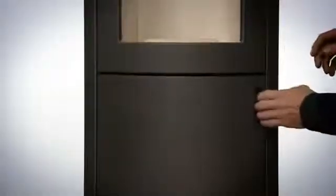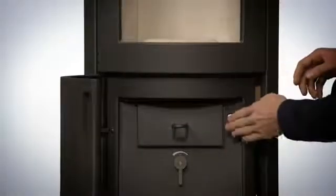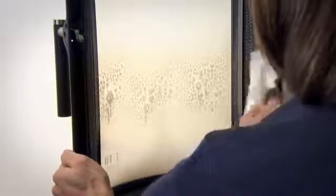If the stove has an ash drawer instead of an ash box, he will close the grate first. Then simply pull out the ash drawer. If heating is being made correctly, the glass usually remains clean. Any soot-like mist on the glass can be cleaned with a special cleansing agent and a paper towel.